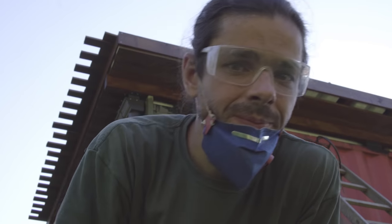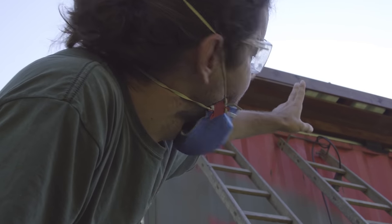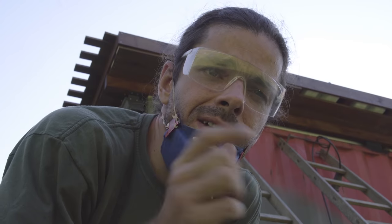We have one problem. We did four layers of the, what do you call it? Soffit. But the last one is not the exact size, so I need to cut the excess, and the excess has an angle. So my friend Michael gave the idea of using a circular saw, using the fascia board as a guide, and just cutting like 2.5 centimeters.